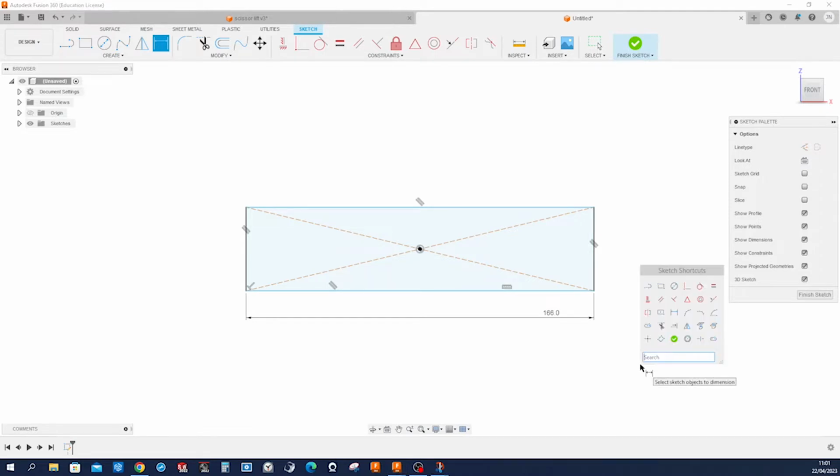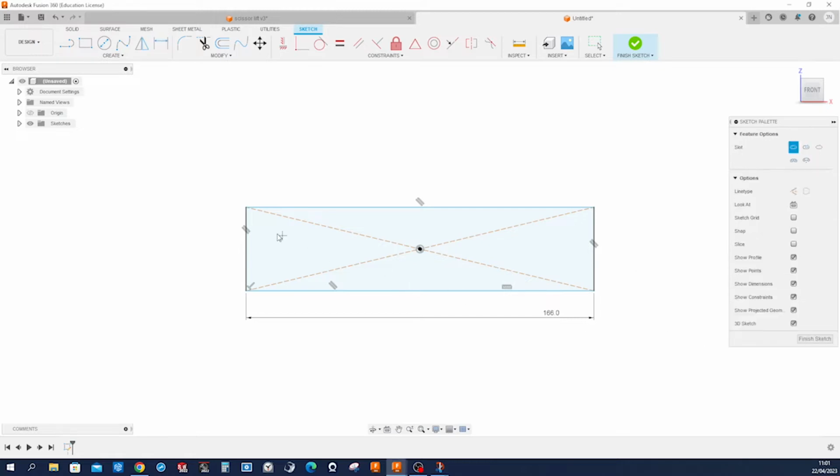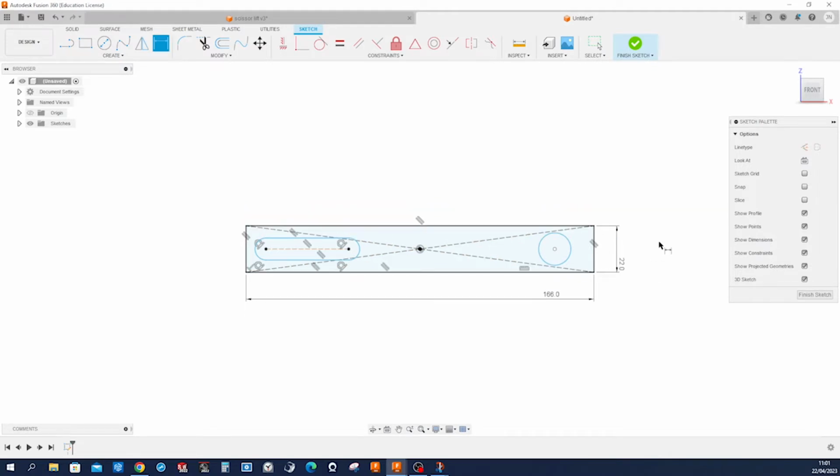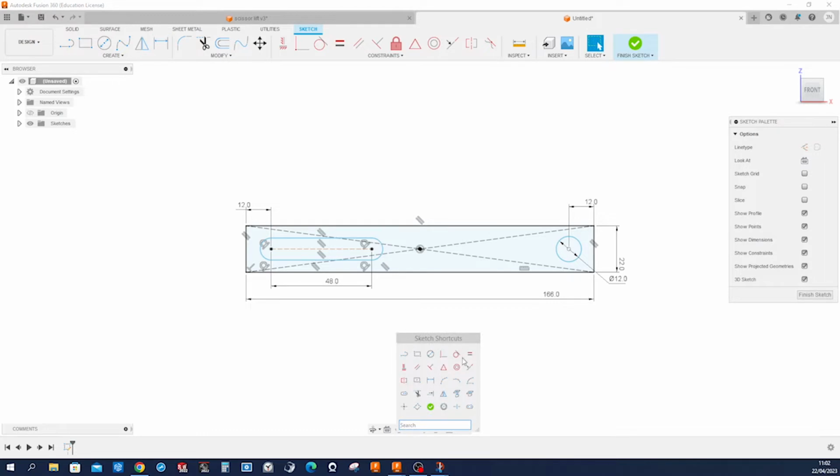And a slot center to center here, a circle over there, a height of 22, diameter of that circle is 12, at a distance of 12, same thing over here. A length of that slot of 48 and an equal relationship between those diameters,